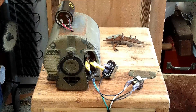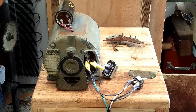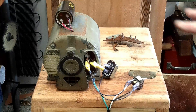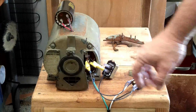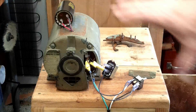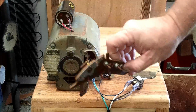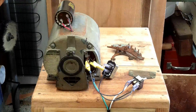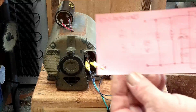What was involved with removing the centrifugal switch was basically to remove the motor from the cradle mount. If you don't have a cradle mount it's a lot easier — this one was a cradle mount so I had to disassemble it from the cradle. As you can see I have a reference mark here. There are long bolts that go through it; remove the long bolts, knock the end cap off, and it exposed the centrifugal start switch mounted inside the motor. Cutting a couple of wires off of it removed it quite easily — there was just a single pin on one side and two screws on the other side holding it in.